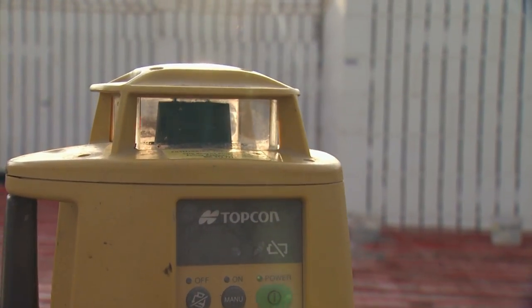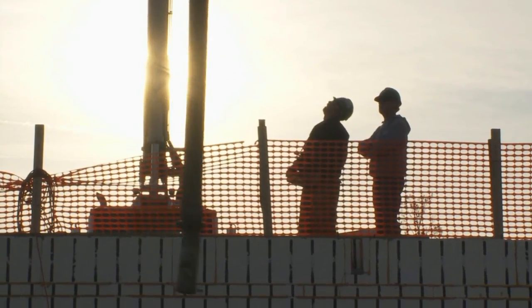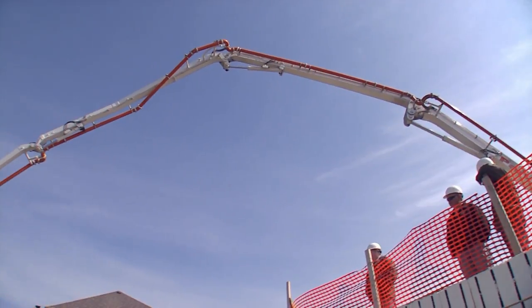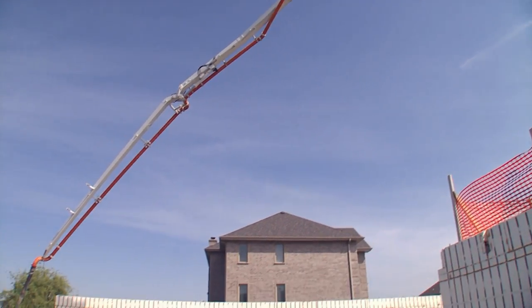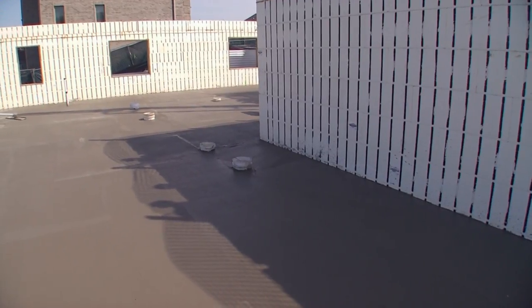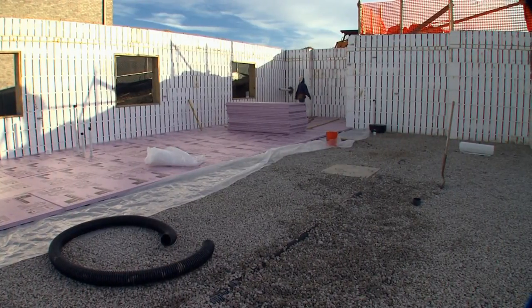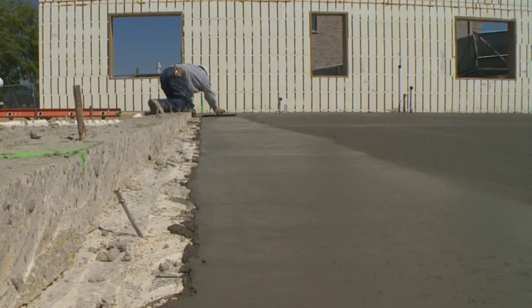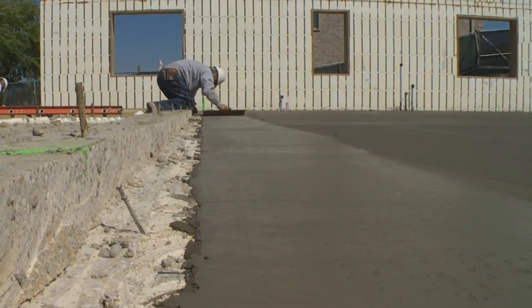From the foundation up, you also have to treat the foundation pretty much the same way. You're going to have the structure — concrete, usually, could be block, depending where you're at. And then insulation, maybe not as much, because the ground is not as extreme — five feet down, it's 55 degrees, it's not minus 10. So you don't necessarily need as much insulation. But you still want to promote drainage.